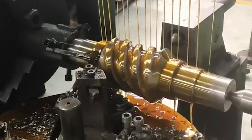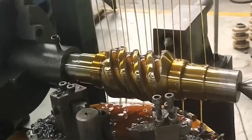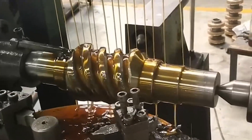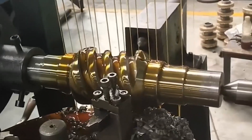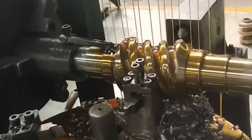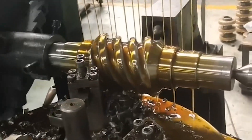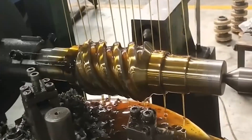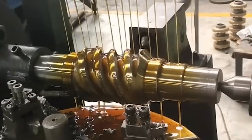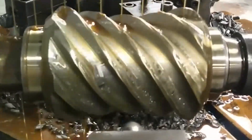The plane envelope toroidal worm drive is a new type of worm drive invented in 1971. This worm gear pair has the following characteristics: the worm tooth surface has high hardness, HRC 58, and the surface is precisely ground after nitride treatment, giving a high and smooth surface. The machining process is highly consistent with the forming principle, resulting in high transmission accuracy. The meshing of the worm and worm wheel is multi-tooth contact, and each tooth is an instantaneous double-line contact.